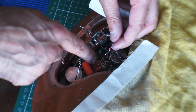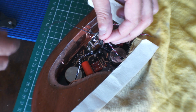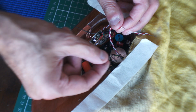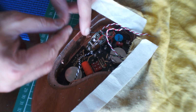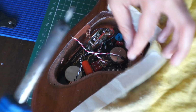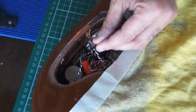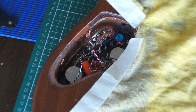Essentially what this does is, when I switch it on, it connects this to the ground, and that turns one of the coils off, or it splits the coils. Then I've got the grounding wires, which are green and plain, and the live wire is black. So now you've got to figure out what the color code of your pickups is, and it changes from manufacturer to manufacturer. So I've got all of the wires ready for both pickups, and I'm ready to wire. I'm going to solder them in. And there you go, all done, all wired up.